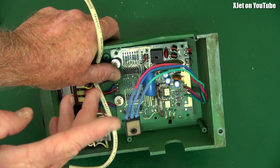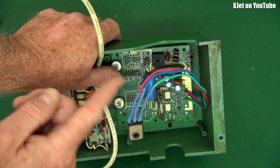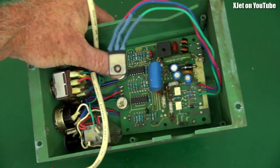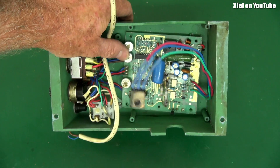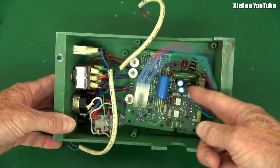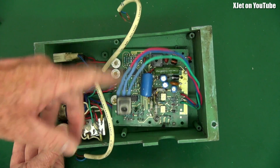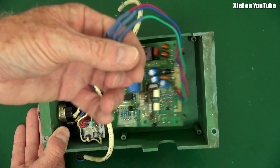That DC goes off to the motor through this control FET. The idea is short pulses for slow rotation, wide pulses for fast rotation, and all this other circuitry is designed so that when you turn the knob, the width of the pulse going to the motor changes. These days we get one-chip solutions to this, and I do have some of those. I may look at that, but I want to make it a bit more fancy when I rebuild this — because I am going to rebuild it and start from scratch.